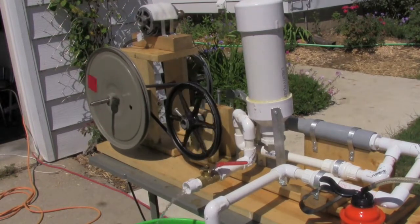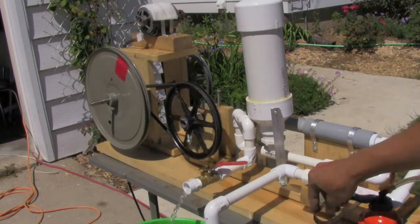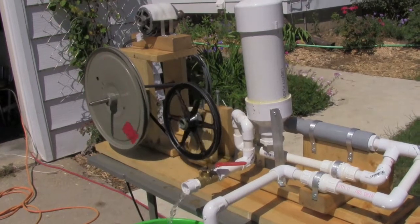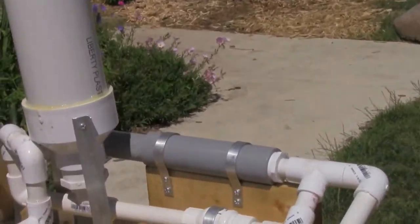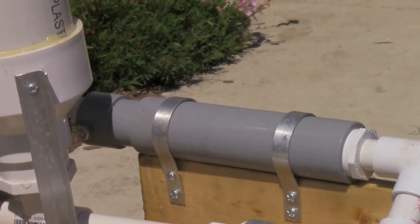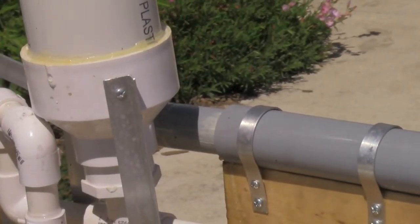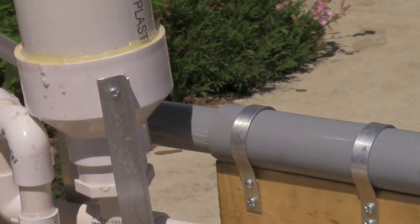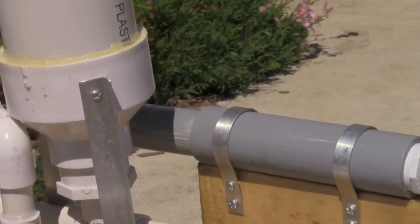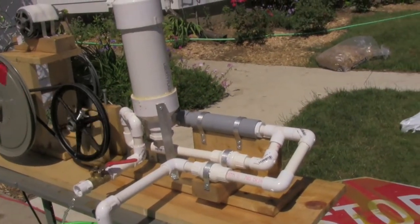The pump part is made out of PVC and electrical PVC pipe, and it's really simple to make. I did just add some more parts, and as you can see, it's electric. Over here, the piston is just an expansion fitting — I'm not sure what it's called exactly for electrical stuff. It's got two rubber O-rings in there and makes a perfect piston. And then I have just a regular PVC pipe cap — not a regular one, a certain type that's kind of got some hex on it. It fits perfectly in there and makes a perfect seal, so it is a piston. And I don't have any glue on it to create a seal. It's just perfect.